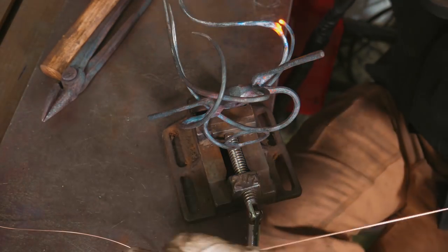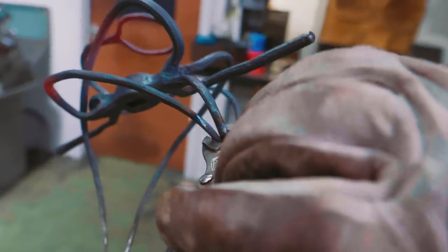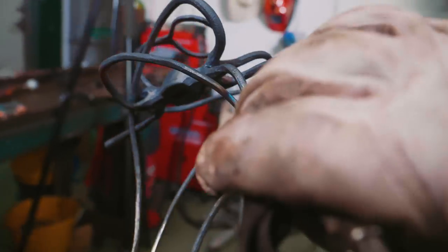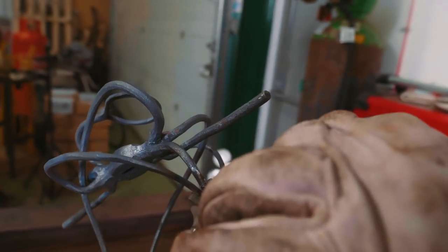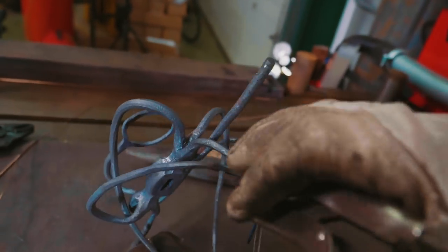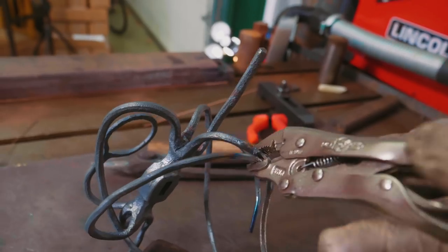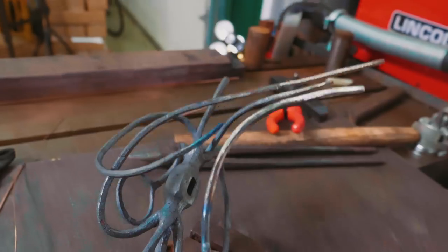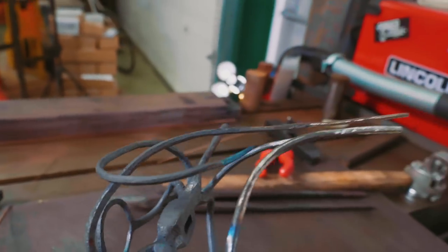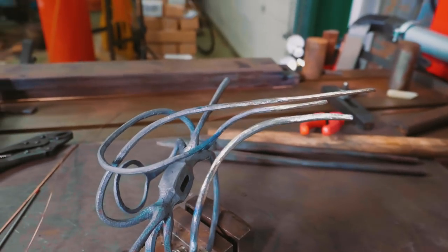Right, so I've gone ahead and ground the pieces, and I'm just heating these up to stress relieve them — to make sure there are no stresses in it when we weld it into position. When I remove this clamp, hopefully it won't spring back too far. I think that's part of why it broke; I think it's also because it was a heat-affected zone. I'm no welder, but we're going to TIG weld that piece back up. I think I'll get all the pieces tacked before going back in the forge, heating up the back end of the splines, stress relieving them, finishing the welds, and going easy — less is more.